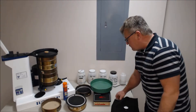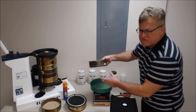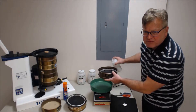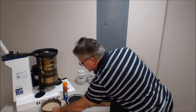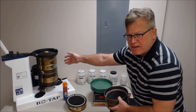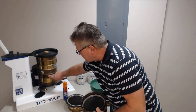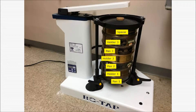After you're ready with your sieve stack, you're going to prepare and get the base value. You're then going to introduce 50 grams of the smallest bead into the stack, and then set the stack up with a pan underneath the holder. We have the Rotap sieve shaker set up on the side. This would be a pan, this would be a holder, this would be a pan holder — and you see that in the auxiliary photograph.